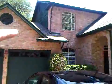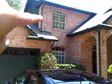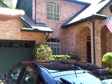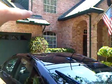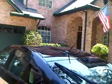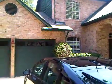Major issue here on the front, we have some pretty severe interior leakage right along this rake line here, and behind this brick column, there's basically like a little inset there from the siding to that brick column. I think a lot of water is getting trapped down on here. We got a really bad flashing job all around here, and I imagine that's continuing back behind that brick column, adding to a lot of the interior water seepage that they're seeing. So we can definitely reflash, maybe just some diverter flashing to help out that area in particular that's in pretty bad shape.